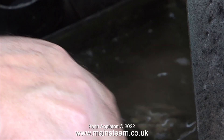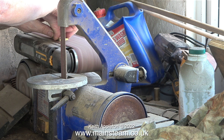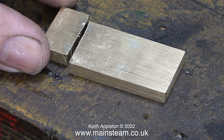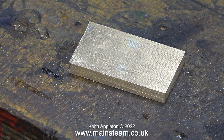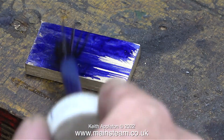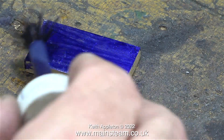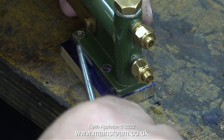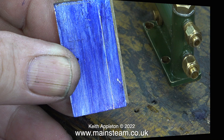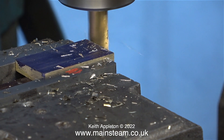It doesn't take long for the brass to cool — I left it a couple of minutes before I quenched it. Using my four-inch belt sander I'm cleaning up all the surfaces of the piece of brass. By using my bandsaw I've chopped off the end, so the piece I'm going to use is just over the finished length I need it to be. I'm applying some marking-out blue, and I notice a slight mark on the top, but this will not be a problem because I need to cut this brass to match the size of the base — first marking it out accurately so the piece of brass becomes the same size as the base of the pump.